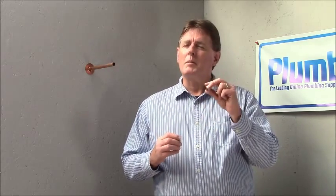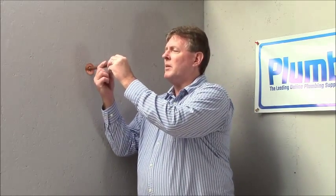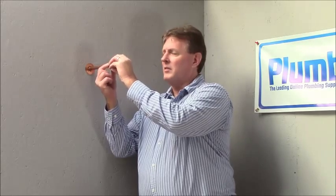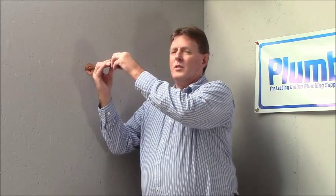One of the most important things about a compression fitting is how it seals, so it's important that you put the sleeve on without damaging it. First, put a nut onto your pipe and slide it down. Then put your sleeve on and slide it down, making sure not to mess up the sides of the sleeve. When you put the fitting on, push it on as far as it can go, then slide the sleeve back with the nut to make it seal. The sleeve seals against the nut on the inside and on the inside of the fitting, so as it compresses, it makes a seal.